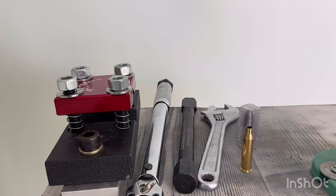I also have a torque wrench, because you're going to need that to consistently torque down the barrel. We'll be doing some testing in the future showing return to zero with the Origin and the Preferred Barrel Blanks barrel. This one I picked up at Harbor Freight — it goes up to 80 foot-pounds. The spec for a shouldered barrel in 223 to 308 is 75 to 85 foot-pounds, so this works just fine.